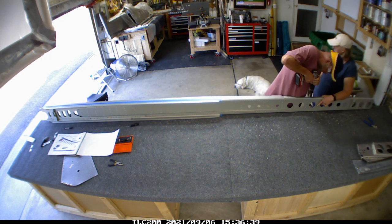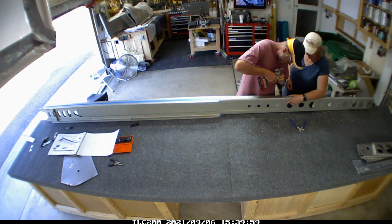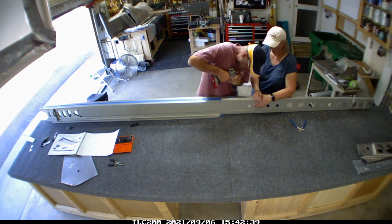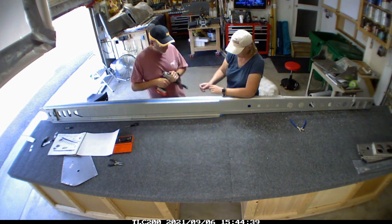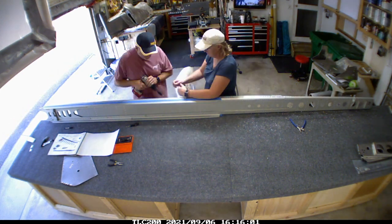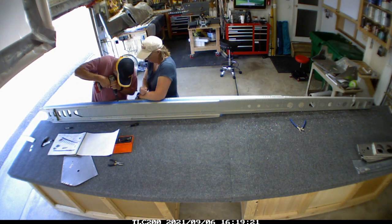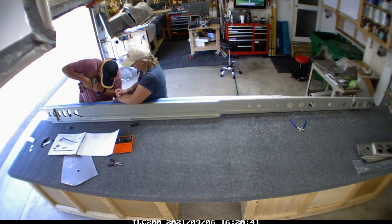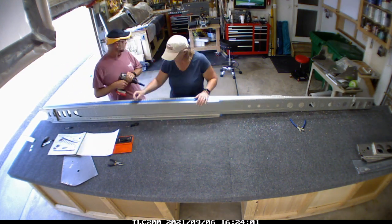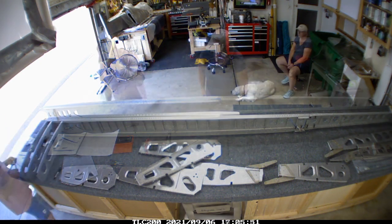There are a whole bunch of those chamfered holes that have to go all the way down the wing spar, and you get all these little chips from the spar itself. What Lori has in her hand — you may be able to catch it — is one of the rivets for this part, and we're basically validating every hole as we go down. I don't know, it'll take us just about as long to do the rest.